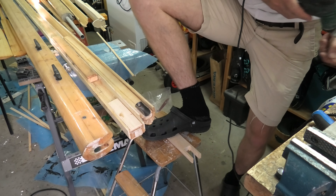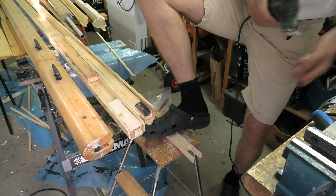I make a hole into the piece and fit the next layer. The pin will swing in through the back end of the mast, thus I need to mark a hole through the back end and cut out some material. As it is thicker than the blade, I need to do it in two goes before I can cut through and trim a bit.